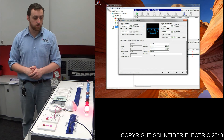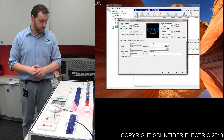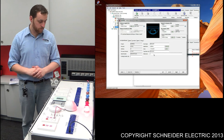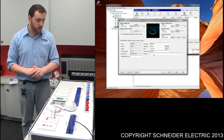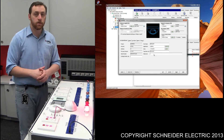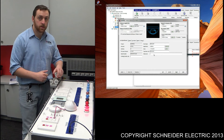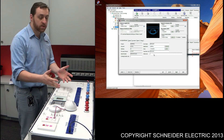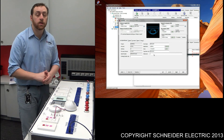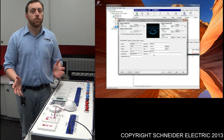The sensor switches those lights off. Now if I go to re-trigger that sensor, the light comes on. To turn the light off, all I need to do is press the key switch, and obviously the lights have gone off. If I try to re-trigger it — because the message was sent from another unit, the sensor knows that, and as a result has disabled itself. That's basically how to program a remote on and a remote off.